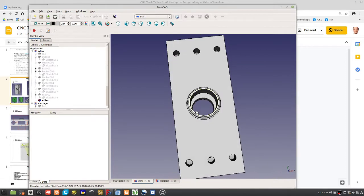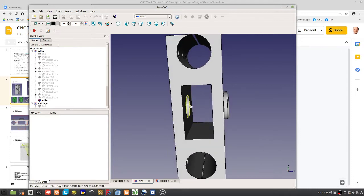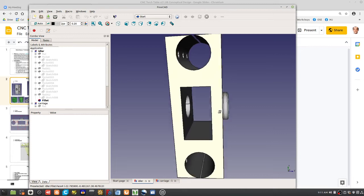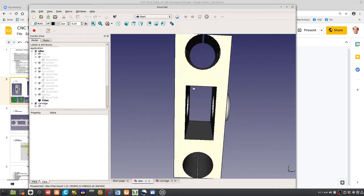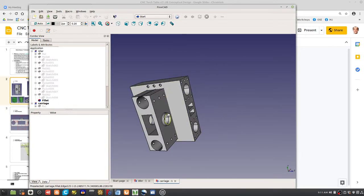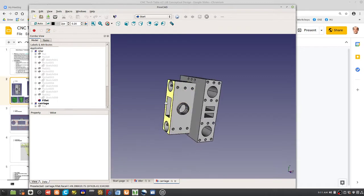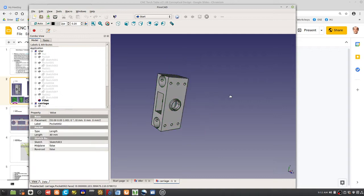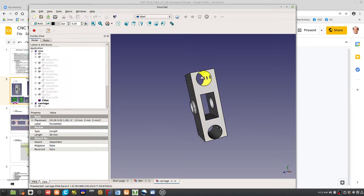That's how the cans work here. And we did this little flange here because the pulley we use is a little wider than allowed by this 40 millimeter distance from side to side. There you go. Let's open up a carriage. So I actually took a look at the carriage and the idler piece as if you were to join them. Immediately you see some things missing, like there's no way to join this carriage. How do you join it? There's nothing on this side here. I would like to see bolt holes.